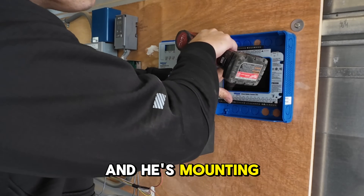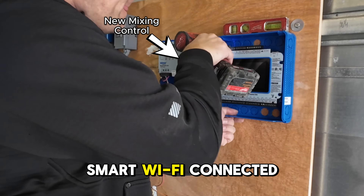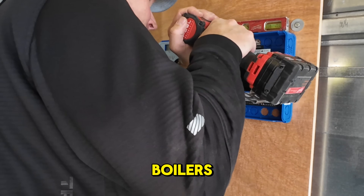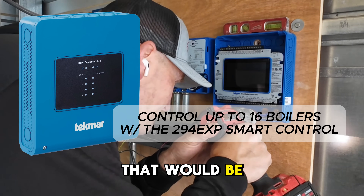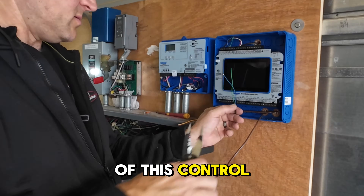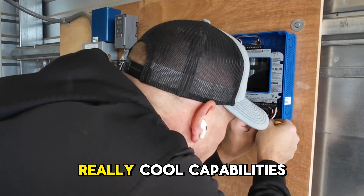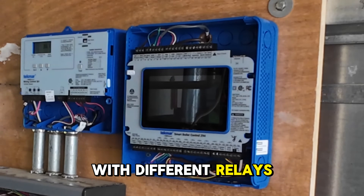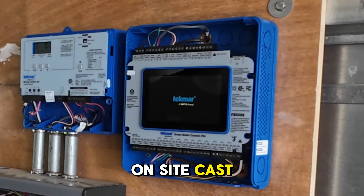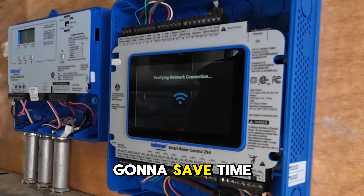Andy's mounting the Tecmar 294 control on the wall. That is a smart Wi-Fi connected remote monitoring control that will handle up to 4 hydronic boilers. They also have a steam model, that would be the 289 model number. Here are the main benefits of this control: easy to wire, familiar interface, simple to power up, and some really cool capabilities with different relays and whatnot. This will handle up to 4 boilers as I said — we've got 2 on-site cast iron. Pretty dumb boilers, but not once we connect this control. So this 294 is going to save time and money.